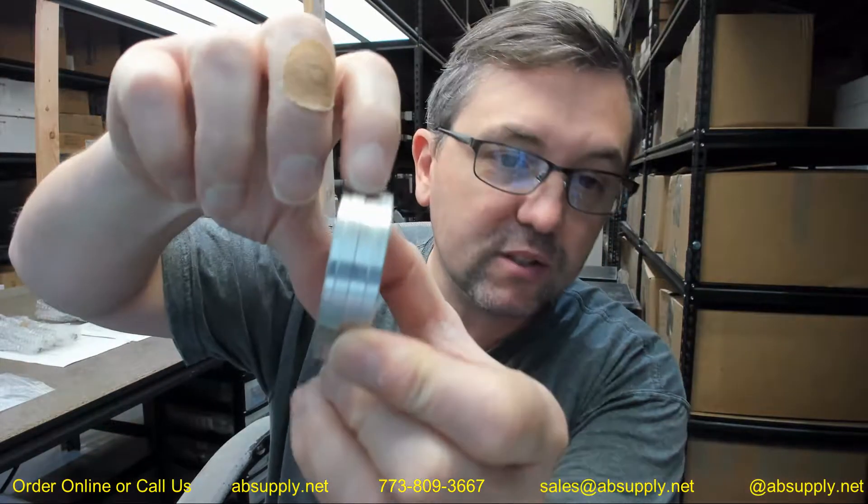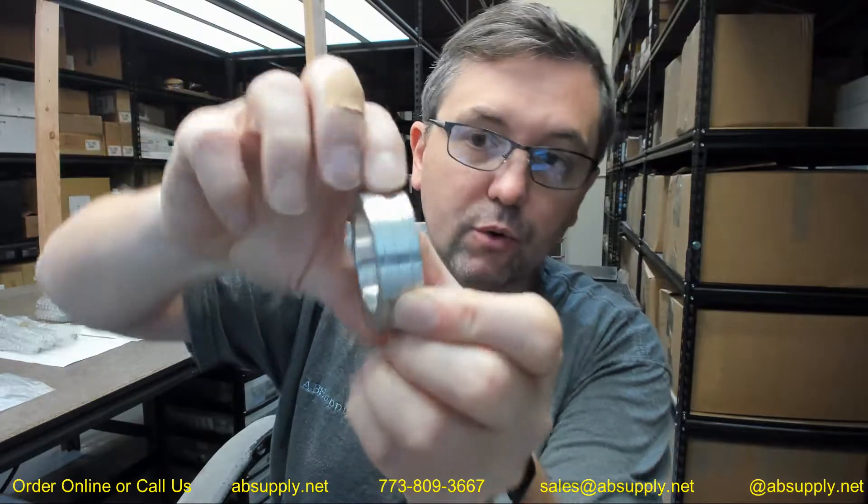The way this is used — and if it is called out somewhere I am missing it — is that this will insert into the hole for the 2-1/8 inch cross bore. There will be a drilled and tapped hole with a set screw that will keep this captive inside of the groove so that it doesn't move on you. That is normally how this works.